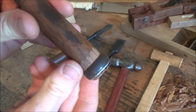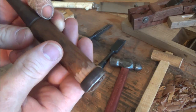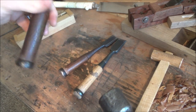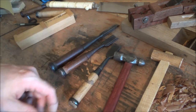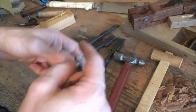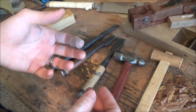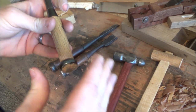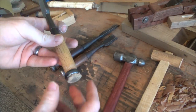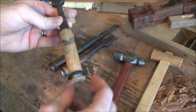The way I prefer to set mine up is a little bit more like this. As you can see, it's a much shorter mushroom on the wood here. Here's another example of the way I kind of like to set them up — just a little bit thin ring around the layer, just kind of mushroomed over. This is just my personal preference. This is not the ultimate way to do this; there are different ways to do it. This is a method that's worked for me, so take from it what you will. Everyone's got a different preference, so if you prefer to have more wood out behind the hoop on your Japanese chisels, that is perfectly fine. I just prefer not to because I feel like it makes it feel kind of mushy and squishy in my hands.